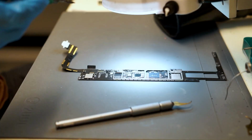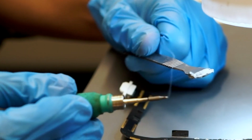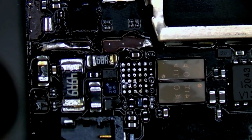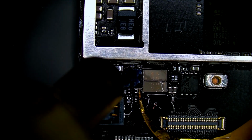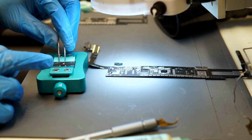Now that the chip is removed, we can clean the bonding pads and prepare the customer board for a replacement IC. Apply 138 degree low melt solder paste to your iron and tin each pad. Now cut a small piece of copper wick and hold it with tweezers. Set hot air down to 300 and, like a brush, go over and flatten each bonding pad. Switch to a donor board and pull a replacement chip. Put it in a fixture and make sure each pad is of uniform size.